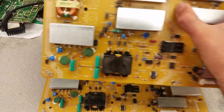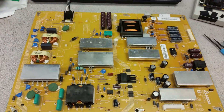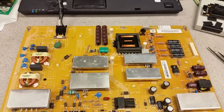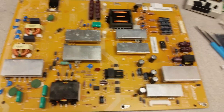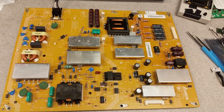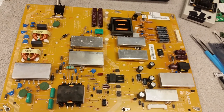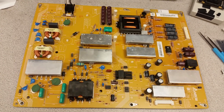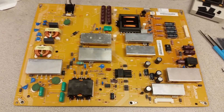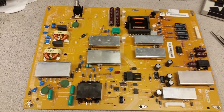In cases like this one, it is simply easier to send back a replacement board. This is the board we're sending back, and that is the original. It does exactly the same thing as this one, except when first activated it makes a buzzing sound. That may be an electrical issue — what we've repaired may not be sufficient — or it may just be a loose leg somewhere on a power transformer, a capacitor, or a heat sink. We'll send this board and see what happens on the customer end. The odds of two or even three boards being defective in the same ways is practically zero. Good luck.